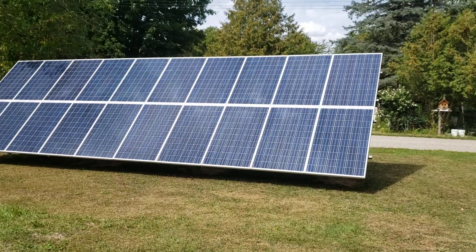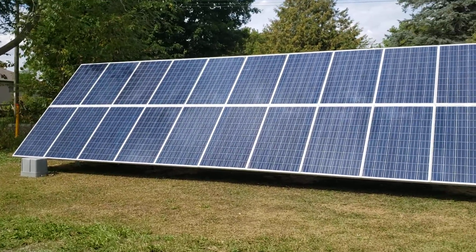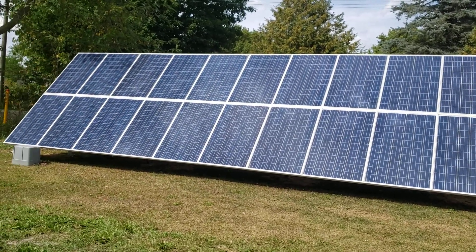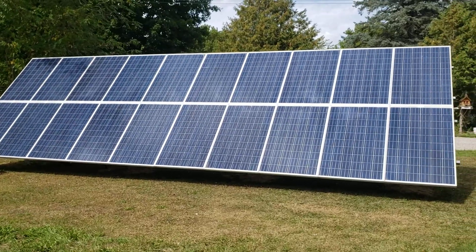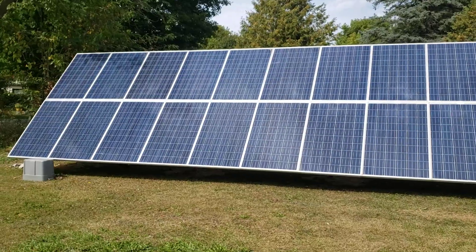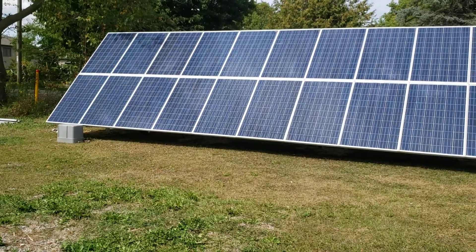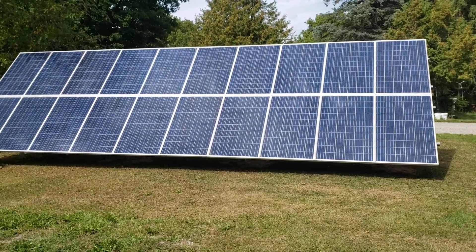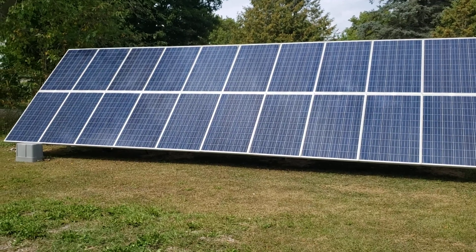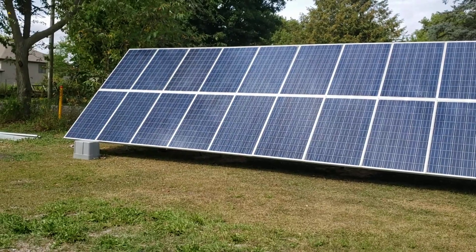Twenty panels, 250 watts each — they're probably about 10 years old now. I tested them all this morning, they're all putting out 32.8 to 32.9 volts, and that was earlier so it's probably a little bit higher now. They're rated for 37, so they're not the highest performance, but the idea is seven will be strung together, and seven and seven to run two heat pumps, and that'll leave six left to charge batteries in the shop.